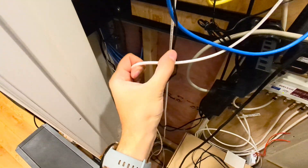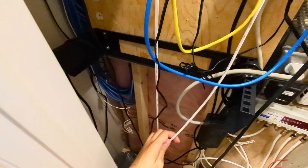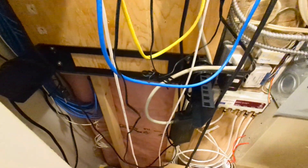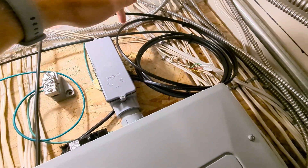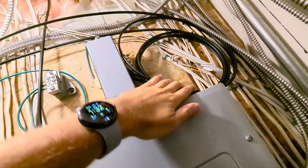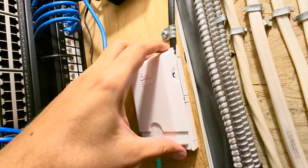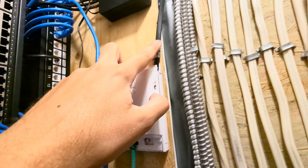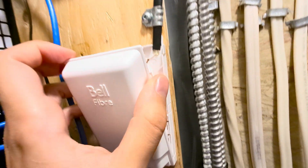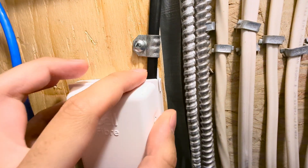...the signal would get really weak on the other end, or you can snap the core fiber inside — and you're going to have a bad time with that. I have a service loop on the inside and a service loop outside. It comes into this Bell box that doesn't close properly, because this box is not rated for this gauge of cable. If you look right here, there's the little opening where the cable is supposed to go in.